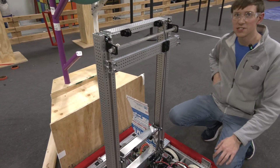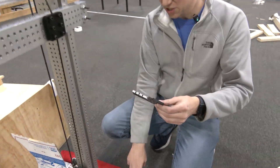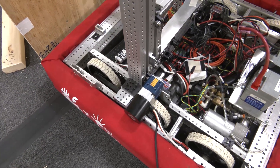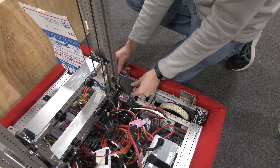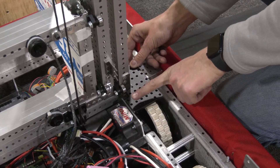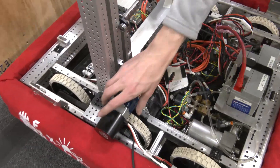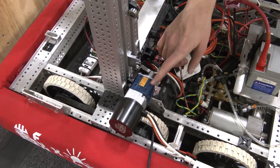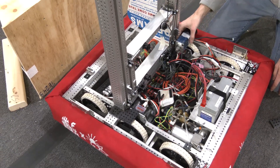One of the only real modifications we've made is these motor mounting brackets. Since our chassis is 26 inches wide as opposed to something like 28 or 30, we've had to trim an inch off of these motor mounting brackets in order for them to slot in beside the elevator and provide enough room for a sport box to hang off of there. These AndyMark Sport Gearboxes are mounting directly to those motor plates, and we're going to end up using a 12-to-1 on both sides, coupling the sport gearbox shafts together using female-to-female hex adapters.